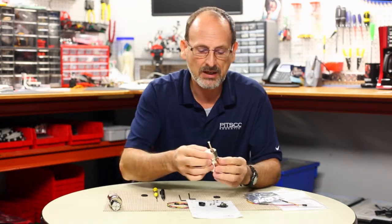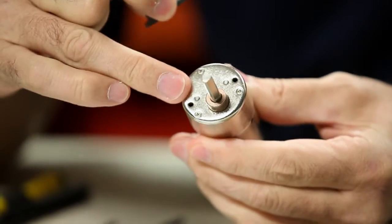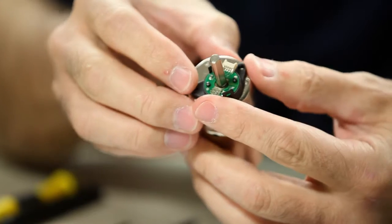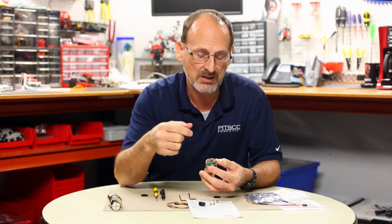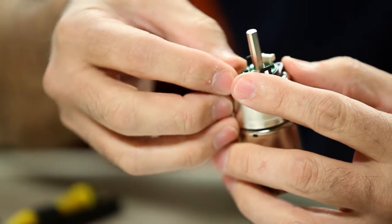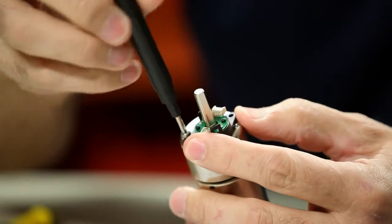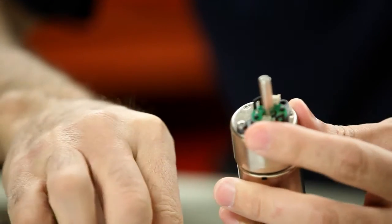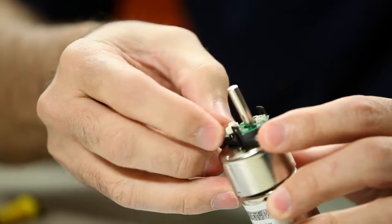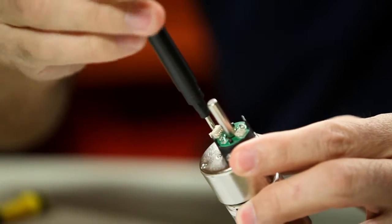To start this process, we're going to begin by mounting the base. There are two holes in the top of the motor that will accept these screws. You mount the base by putting it over the shaft — the encoder has to go around the rotating shaft of the motor, otherwise it can't read the rotations. You will need a Phillips head screwdriver; you can use your four-in-one screwdriver. Just snug that down, and use some common sense — don't tighten one side all the way down without putting the other screw in. Balance it out and make sure you don't put too much torque, but it should fit right on there.